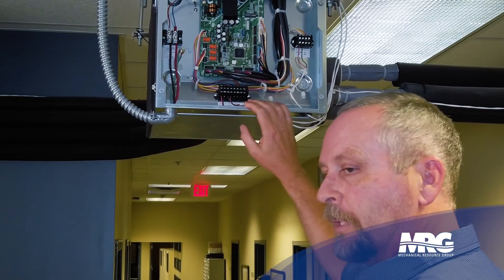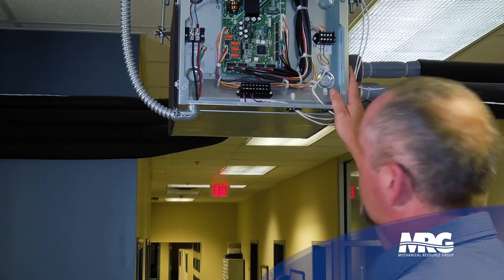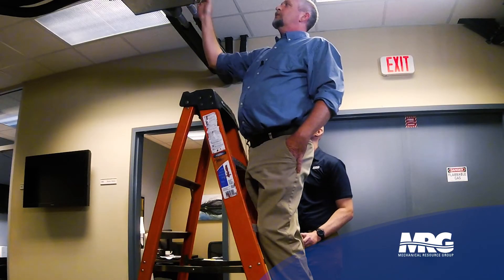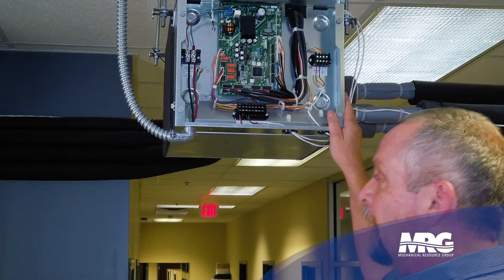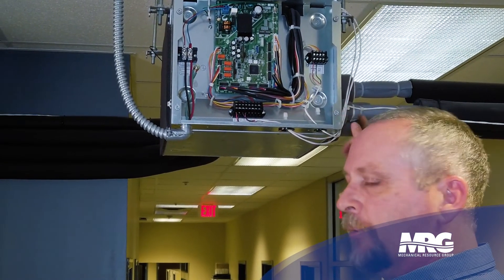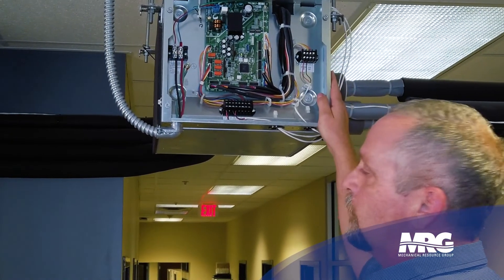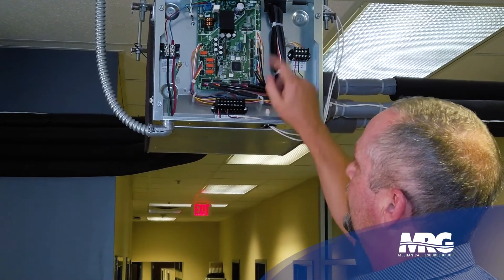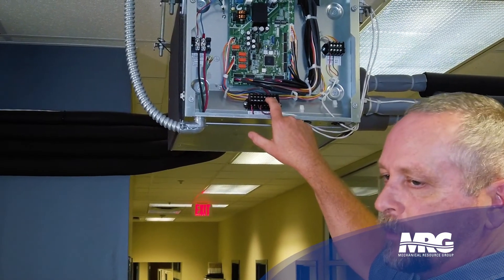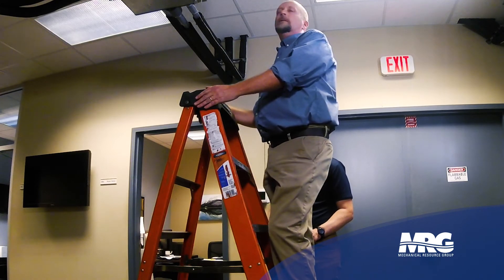The big thing with branch selector boxes: always make sure when you leave this terminal — the best way to do this is, if this is port A or B, strap the comm wire off to the piping that leaves that port and it'll go right to the correct indoor unit. When the wiring gets run after the piping, that's when we typically see problems. There is one other thing to touch on: dip switches. If I have ports I'm not going to use — this is a four-port box and I'm only using a few — I've got to go turn a dip switch and tell the box there's nothing connected to that port. We cover this in our startup training. The COM wiring going to the indoor unit is super critical to catch every time. If you get it right the first time, you'll never have any problems — this unit will be rock solid.